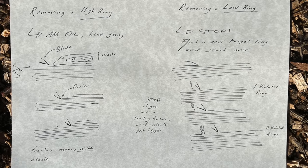You can use this simple test to verify if a ring is above or below when it's hard to tell. When you're carving on the frontier between two rings, if the frontier keeps moving ahead of your knife, you're on the right path and removing higher-up growth rings. If you notice the frontier go in the other direction — behind your knife — you just gouged into a lower growth ring. Stop as soon as possible. Once you get all the way across a single crunchy early wood ring, you can be done. You can remove the crunchy layer now or save it for later to protect the back from scratches during rough work. Removing it is easily done with a scraper.